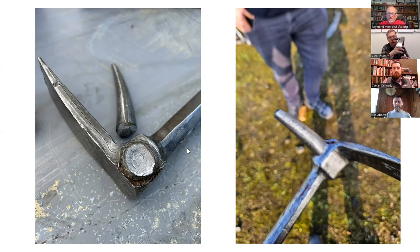This is a Council TD-30 — another forged bar, but it's a single piece. They forge the adze flat out, and from what I'm told, they stick it in a vise and bend it down after reheating the head. The Pro Bar from FHU, which is the most popular Halligan bar on the market, does a similar process, with a little more variability in their head. At Council's forge they check that the radius arc is the same every bar — 30 inches to the forks. But these are hand-bent in a vise for most, if not all, of the forged manufacturers. Paratech should be the same way. Hazel's is cast; I'm not sure what Firemall's doing — there's a forge now but I haven't had my hands on one long enough to know.